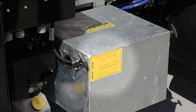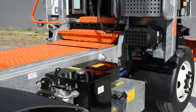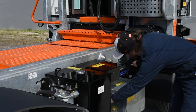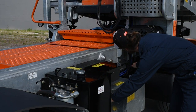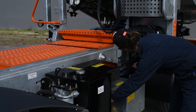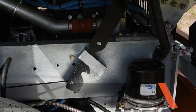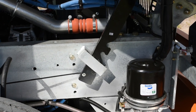There is also a warning label with the cab tilt instructions located on the frame by the cab tilt switch. Keep clear of the cab when raising or lowering. Should you need to tilt the cab, pull the cab latch bar release handle to the rear. While holding the handle, move the tilt control switch to the up position and hold until the cab latch bar clicks into the locked position. Never place any part of your body under a tilted cab without checking to be sure that the cab latch bar is in the locked position.